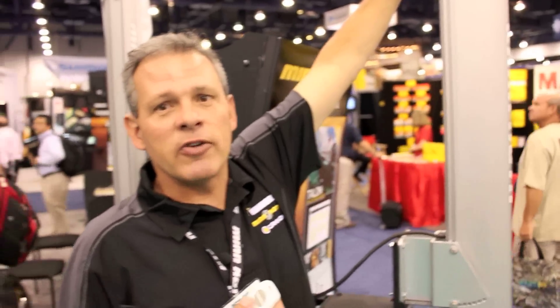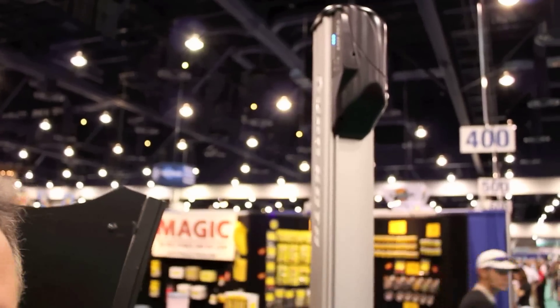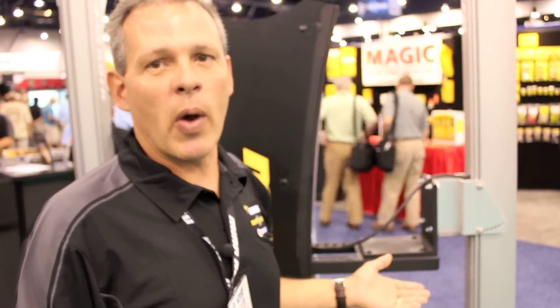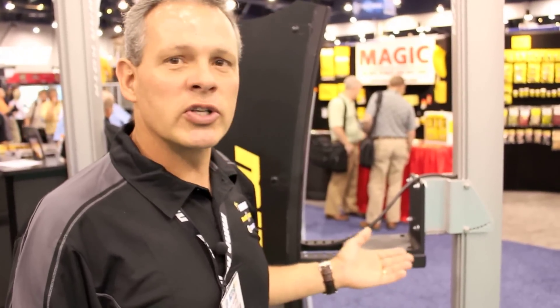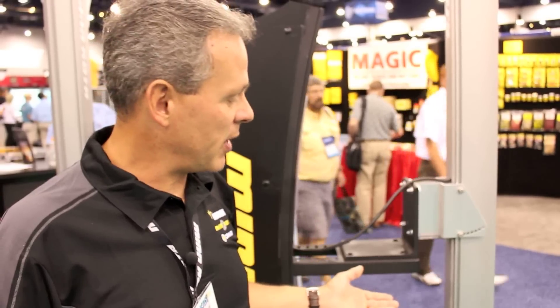We also have a unique feature called rough water mode. When the user turns on rough water mode, the unit will deploy the anchor to full depth. It'll do the three hits provided by Auto Drive, then the unit will wait ten seconds and hit the anchor down three more times. It'll wait an additional ten seconds and drop the anchor again three more times — for a total of nine hits — ensuring the anchor is fully seated in the worst possible conditions.